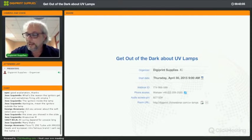The thing is that if you have good curing on the CMYK colors and not so good curing on the light colors, and I don't even know if your printer Flora F1, yeah, I think so, has light cyan and light magenta, no? If you have less curing on that, then I would have a look at the inks, to be honest, because there's nothing else that makes sense unless,